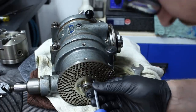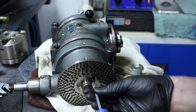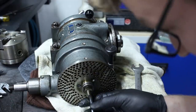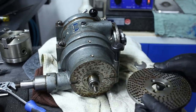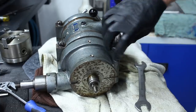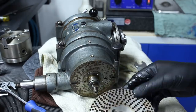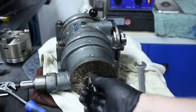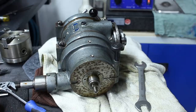We can take off these three screws to remove the index plate. It came only with this index plate — I'll see if I can get the others; they show up on eBay, but I have to find the right size and hole count. Here is the split lock for the mounting point of the index plate, which is connected to the shaft back there for spiral milling.